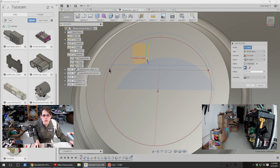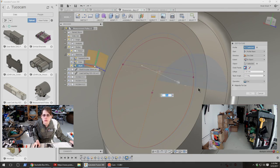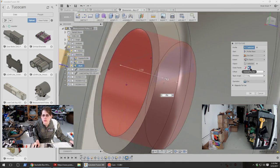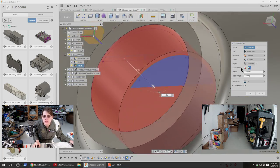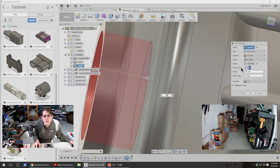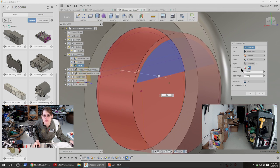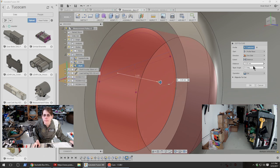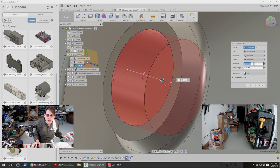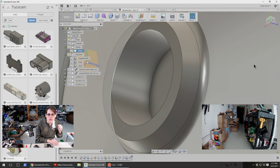So here. Okay, I don't know if I can use edge chaining now that I'm making this shape so much more complicated. So let's start out with just this. I think I want to leave a little bit of extra room, though. So that was 3 millimeters. I'm just going to enter 3.45 millimeters, perhaps.